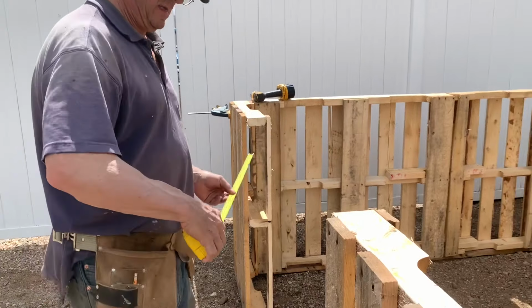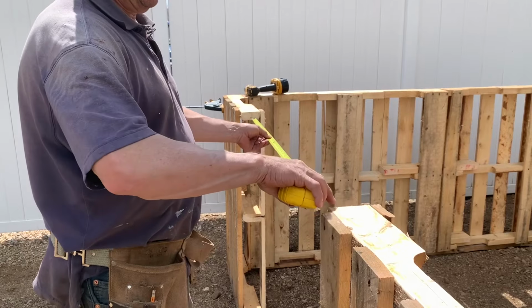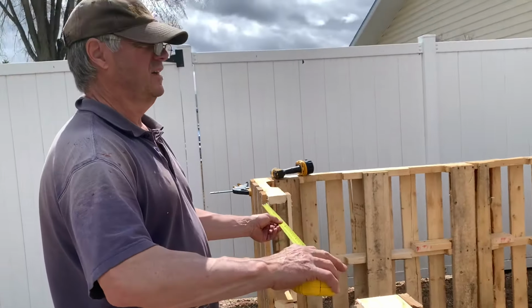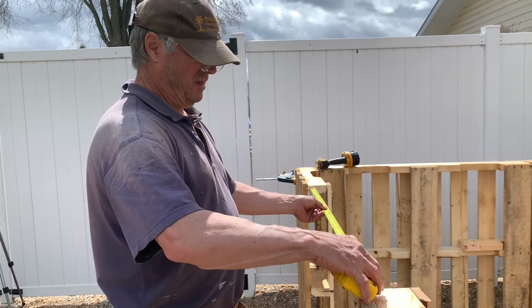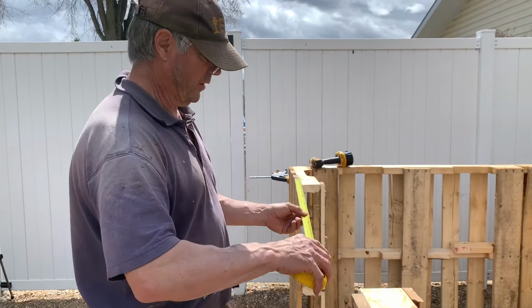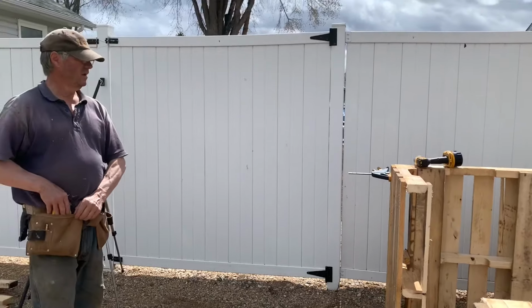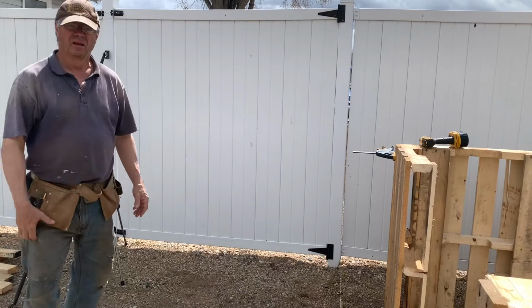It's 49 inches now, and you'll take a double header. So you take 3 inches off each side. So 46, 7, 8. Usable 41 inches. So that's a good size door. I think that'll work. Well, that's the thing, because a house door is what, 36 inches? Yeah.